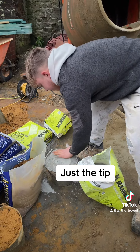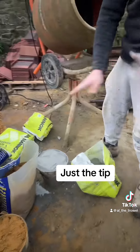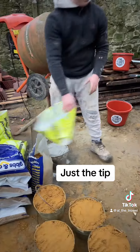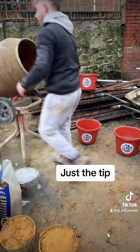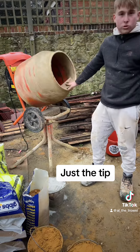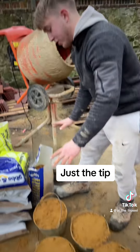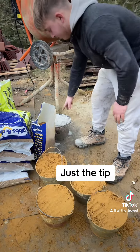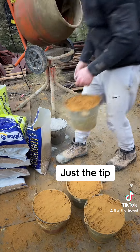I've just worked out why I wait forever to get my part. Now I've got all the gauge set out and ready to go — this is a new experience for me too, boys. So this is when you turn the mixer on. Water's already in. With a four and one, the best way to do it is you throw two sand in, then one cement, then the other two sand — so the cement goes in the middle, know what I mean.